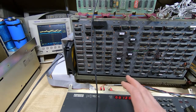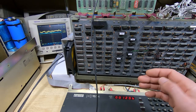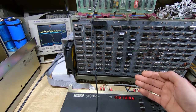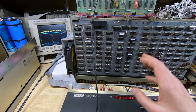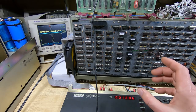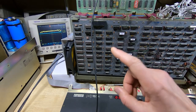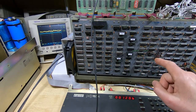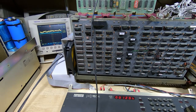So this is what I'm doing. I'm going through the system, running these test programs, doing one function at a time. So I'm doing read sector testing, in-depth, write sector, empty buffer, fill buffer. And where I'm getting problems, by the look of it, is when it's trying to communicate between the drive and the RAM on the PDP. So this may still be a problem with the CPU on the PDP.